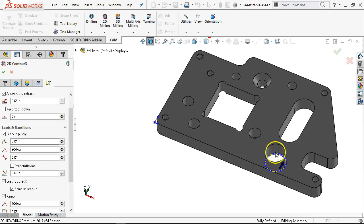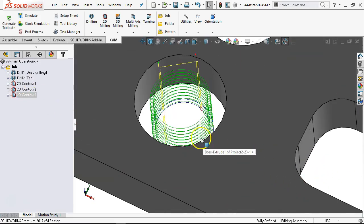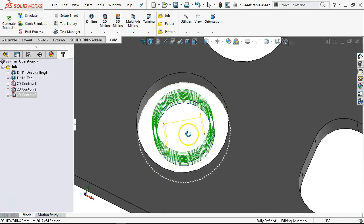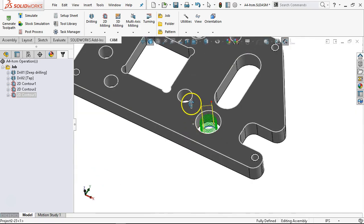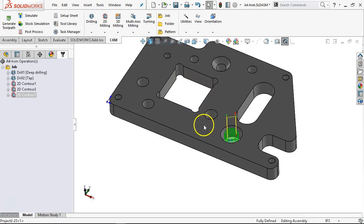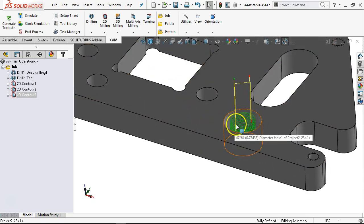The issue here is this is big enough that I will either leave an island around that hole, or have a big enough chunk of material that I really want to make sure that goes away. It found it, made two passes, and apparently it wasn't as large as I thought. I can take that second step — it is jumping up and going to do a second helical pass in.